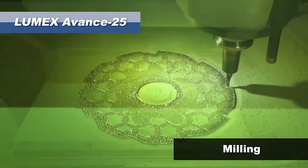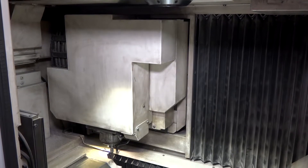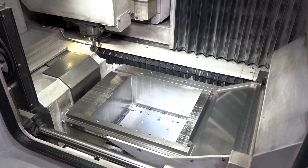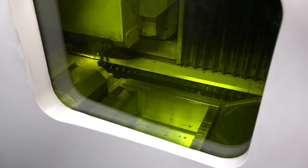How good is that surface finish? Is the subtractive side similar to a normal Matsuura machine — are you getting the same sort of accuracies as you would expect on one of their normal machine tools? Yes, the Matsuura brand is very strong and well reputed as one of the best machinery manufacturers in the world. You get three-axis accuracy with this machine, so you get surface finishes down to around RA 0.3 to 0.5 on very small geometries, and slightly larger on other geometries.